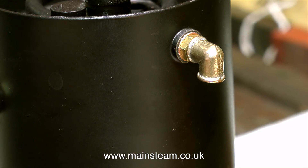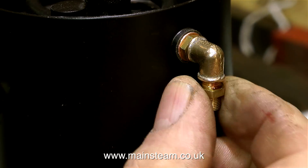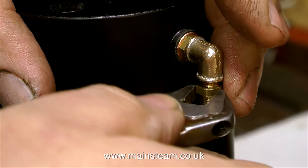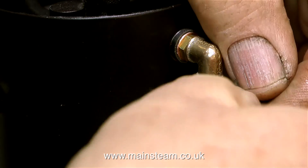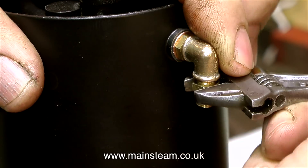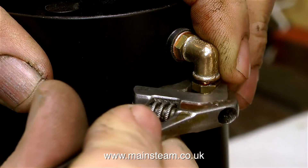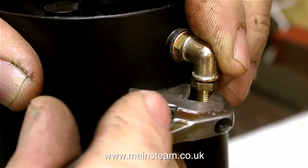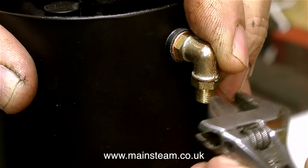In this clip you get a clear idea of what I'm trying to achieve. I need the live steam pipe to point downwards — I generally try to do this when building steam plants. It's not always possible, but it's better if the live steam pipe is low down on the board; then there's less chance of the operator touching it and getting burnt. Although I will be wrapping it in string. I can't say I'm looking forward to wrapping all of the live steam piping in string, because it takes quite a while and it's quite tedious.